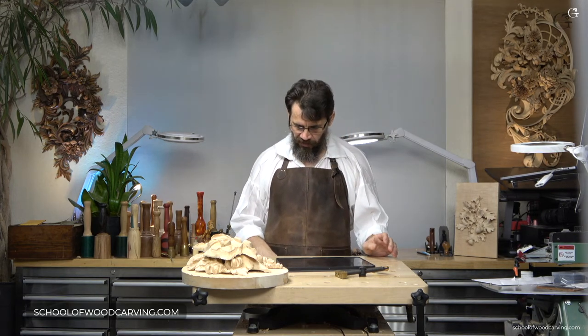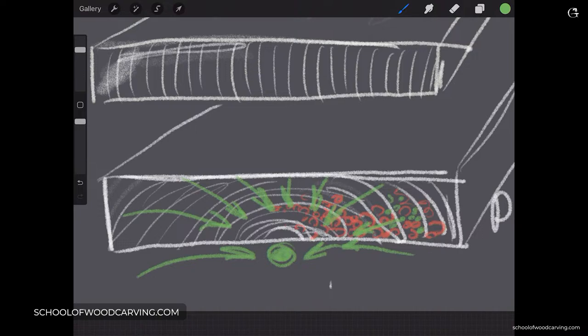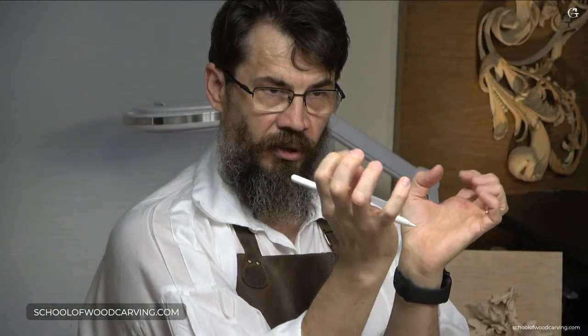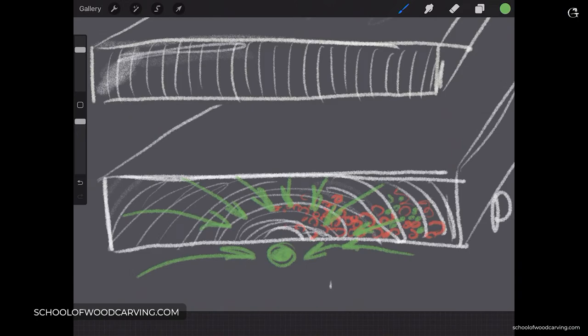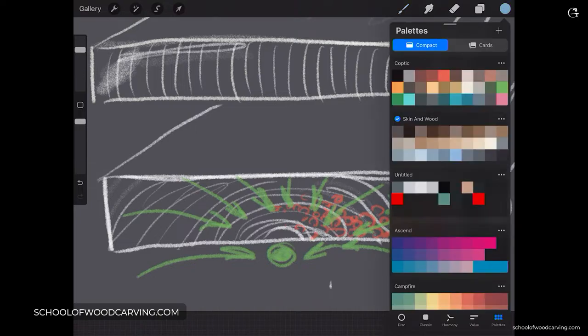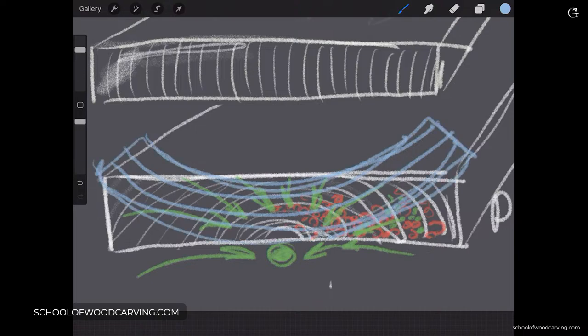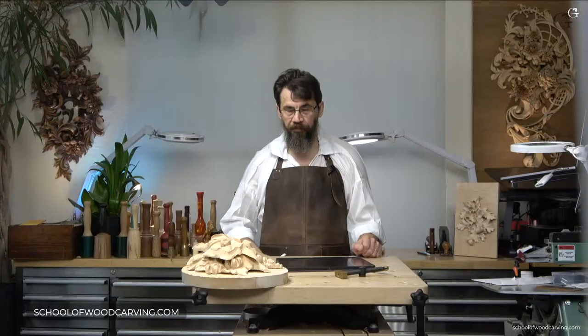My question is, when you look at that piece of wood, what direction is it going to warp? What direction is it going to move? The force is going from all directions toward the center, and it's just drying out, and it starts moving either up or down. So look at that picture and tell me what direction it should move. Let me change the color, and I'll try to be logical. If everything is dried right between those and all the force goes toward the center, most logically, the warping is going to happen in the opposite direction. So it's going to warp like that, okay? Your board at the end is going to look like this. I hope it makes sense. Okay, so that is how it's going to look.